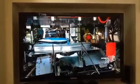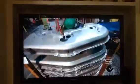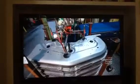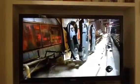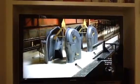They transfer the mower decks to a series of presses, which punch holes for the blade attachments and trim the edges. Workers stack the decks for washing. After a treatment with a chemical rust inhibitor, it's time to plunge them into a primer solution. The overhead rack delivers a negative charge to the decks, while the primer has a positive charge, which draws it onto the decks in an even coat. This is called electrostatic painting.